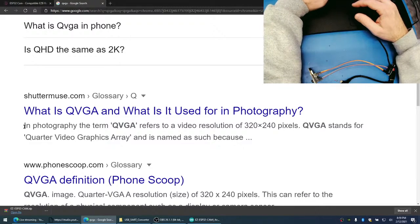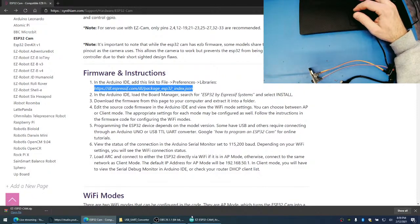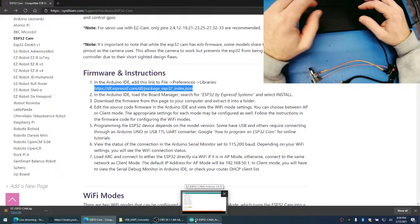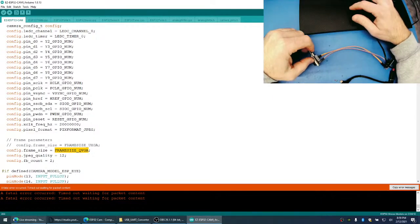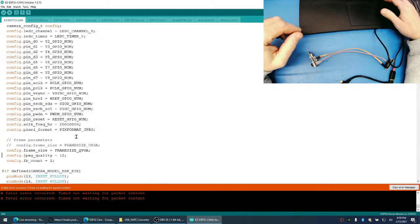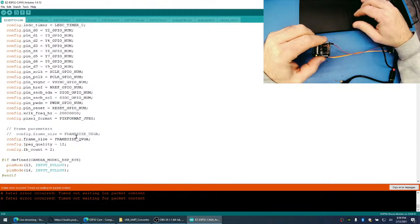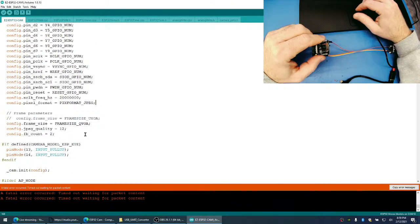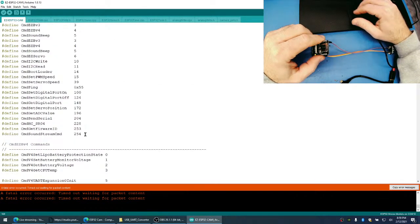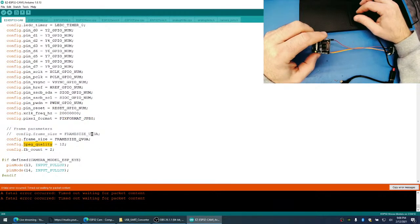So it's the same as the Easy Robot camera. It's just not as clear and a little bit noisy. Nink, of course, discovered a way to make it less noisy by disconnecting the wires going to the UARTs. But it's still not a very great camera. A lot of it is because in the Easy Robot camera firmware we're doing a lot of fanciness with analyzing the picture, but this is just taking the direct raw video feed and throwing it into a JPEG with some JPEG compression and then throwing it over the wire.